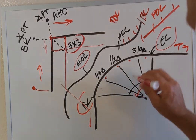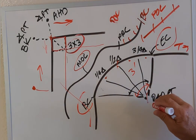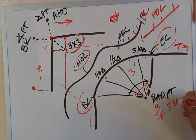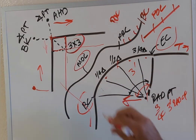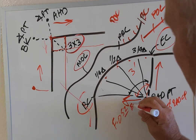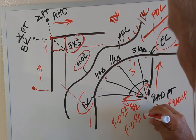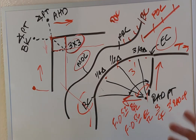If this is a three-foot radius — meaning three feet from there to the radius point — we may stake a radius point, still three feet off curb face. On the back it would say something like 'three-foot radius curb face,' and there would be two grades on there: normally a grade to the BC and a grade to the EC. So it might say fill of 0.52 BC TC and fill of 0.56 EC TC. That's what you'll normally see on line work.